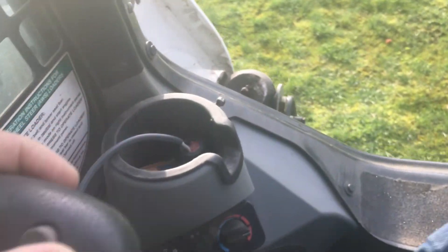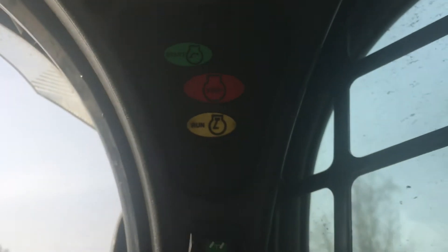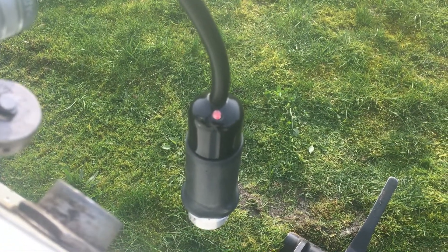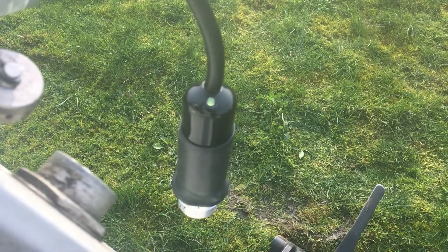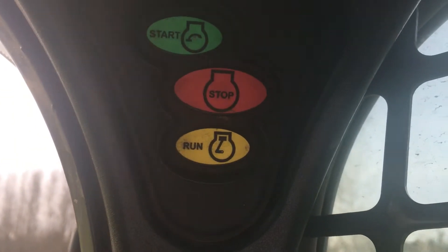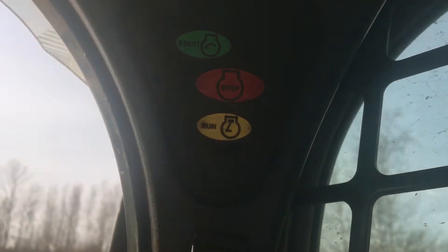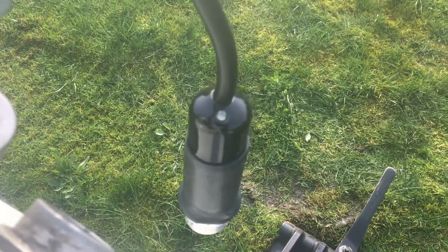You'll see exactly what happens on the controller as well. While I hold this button down I'm going to reach up and hit my run button. I look down and what I see is the red LED locked on, and I'm holding it until it changes from status red to green — that tells me I've programmed it. What I have to do now is come back up and hit my stop button. Now it's locked it in place. When I turn this back on again and hit my run button it comes back on and the LED is flickering, which tells me the status is good.